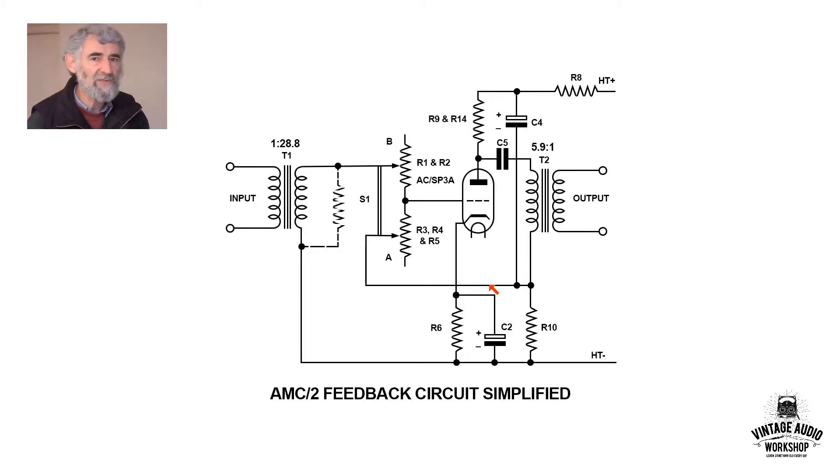This is a little surprising, because in the full circuit you will see there is double decoupling of the supply. Also, in professional equipment, I wouldn't expect to find any ripple of significance on the HT line — either because it was a regulated supply, or heavily smoothed, or stabilised using a giant neon voltage regulator valve. They also used a very large bypass capacitor in the cathode: 100 microfarads, which by modern standards isn't very big, but in the days when this was manufactured it was quite a large capacitance.